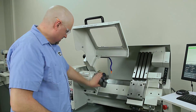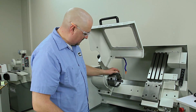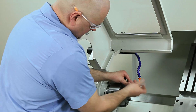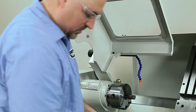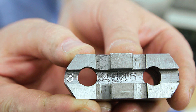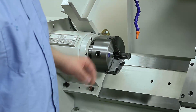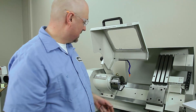So you've got your chuck mounted with the witness marks on it, either stamped or Dremeled in. Now if you want to put a set of soft jaws on, just take the hard jaws off. If you look on the inside of the jaw, there's going to be a number — this one's got a 3 on it. You might want to take a marker and put the number on the outside, or etch it with a Dremel into your master jaw, so these go back on the same way you take them off. When you put soft jaws on, number them also so they correspond. Then if you ever switch soft jaws or put your hard jaws back in, everything's going to repeat real well for you.